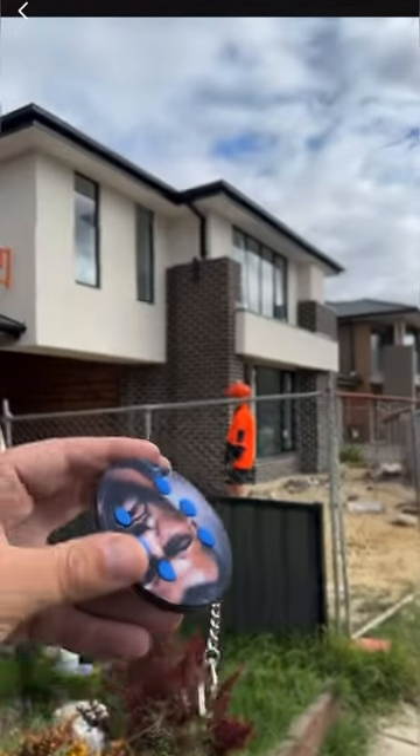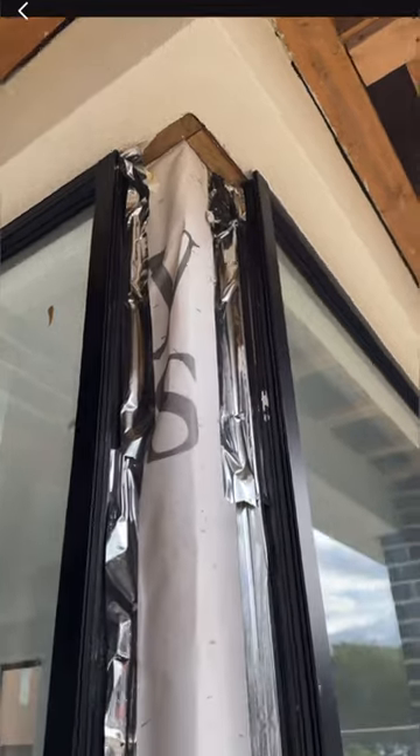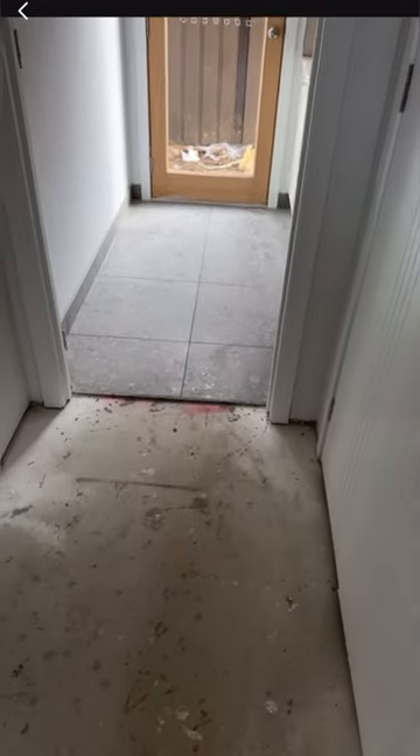I can smell the non-conforming works in the air. Beautiful tape job — look at this. You can see the membrane just finishes hard up against the wall, and then you've got the architrave right here that butts into the tile. Now when water goes behind the grout, it is going to deteriorate that architrave.